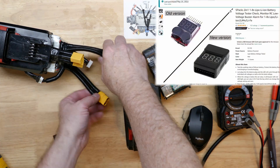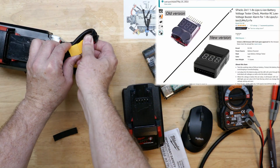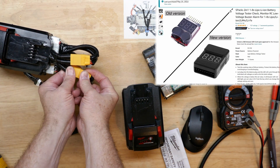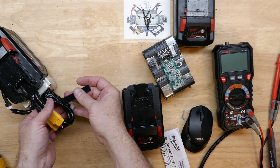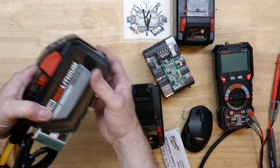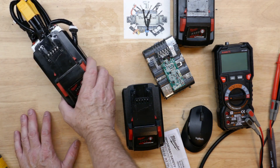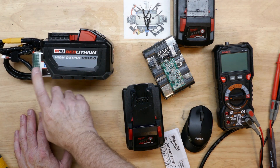I do like using a little hobby battery tester — I can take that and hook it to the other lead, so I really like being able to have a visual check on all my cells, as well as the battery monitor in one of the pack cells itself. The BMS is monitoring one battery and its cells individually, and we can also visually and audibly detect if we have an issue with the other one — kind of a double check.